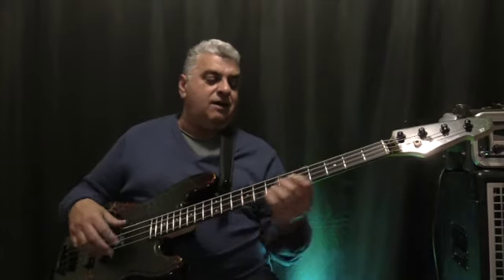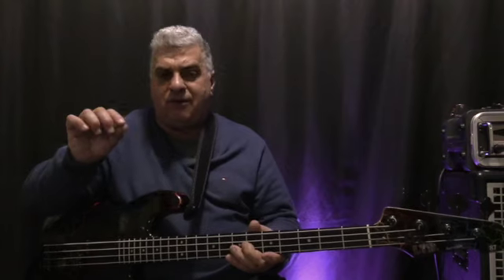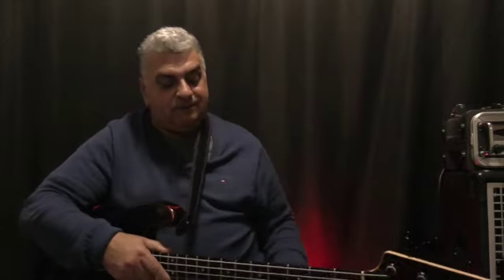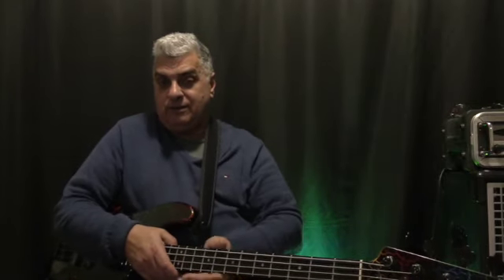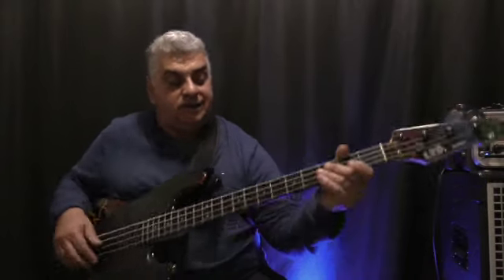Playing up the back of the neck, I noticed a lot of drag in places on the finish. I thought there was some sticky residue, so I tried to clean it, but as I looked closer, I noticed there was a very fine orange peel in the finish in places. When your thumb got to those spots, it kind of got stuck. I thought about sending it back, but I knew they only had maybe one left. So I went over it with very fine wet and dry paper, smoothed it out, and now it's beautifully smooth and easy to play. I also cut the nut properly and adjusted everything.